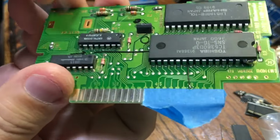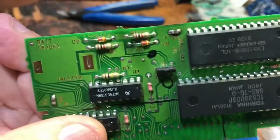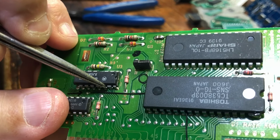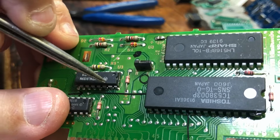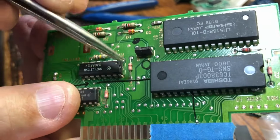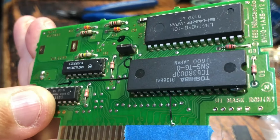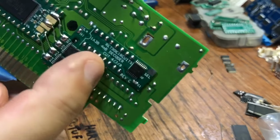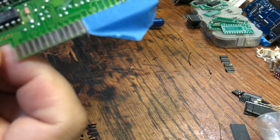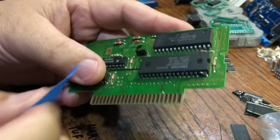and this wire here, well, this trace connects to here. Now, in the original decoding, pin 7 is connected to pin 15. And so what we're doing is we're using pin 15 as a throughput, as just a connection point. So the wire comes up here and connects to pin 15, which is that via. And that is just our pathway to get that signal to the decoder, to all this. So, all right, this should be ready. Soldered, cut, yeah, all right.